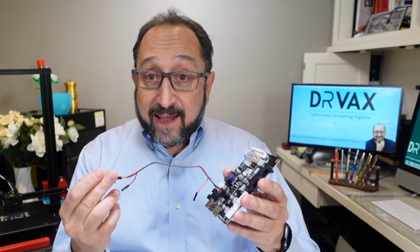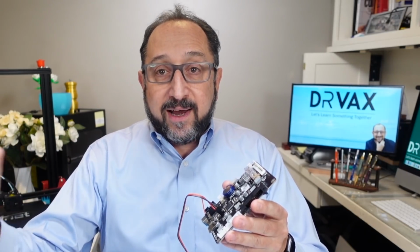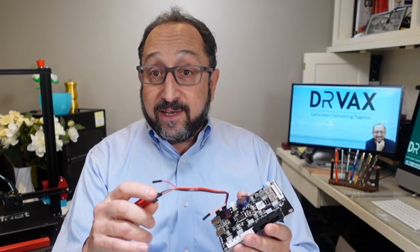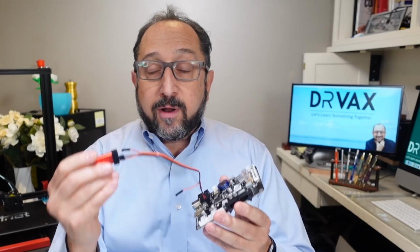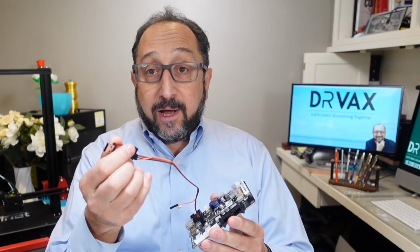Now, it's not going to be as easy as this because this is going to be inside your printer. So you have to turn your printer on its side, you have to take the back off, you have to make these connections. Be careful, because the pins on the opposite end of the STlink device are power pins. You do not want to connect those. You could damage your board or your STlink if you do that. Then plug this into a USB port on your computer. And yes, you can use an extension cable, which I needed to use, and carefully turn on your printer.